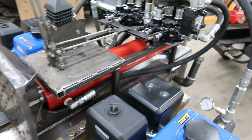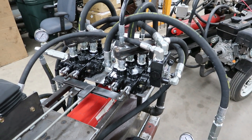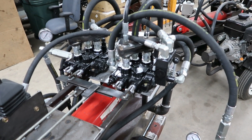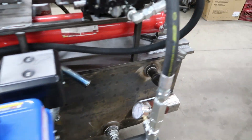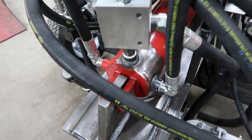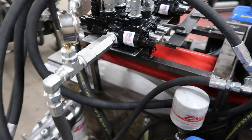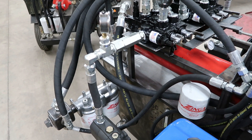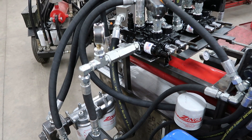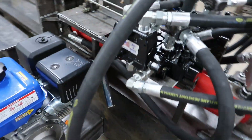There are two auto-return / auto-cycle valves. Since both pumps are 28 gallons a minute, I can't force all that through one valve, so I split it into two valves and made T-manifolds for the return. I had to weld extra bungs on the cylinder — one for the dump valve and another for the auxiliary auto-cycle valve, plus the base port and rod port. For one engine to work at a time I installed inline check valves so pressure wouldn't push backward onto the other pump when its motor isn't running. The proof of concept works well.